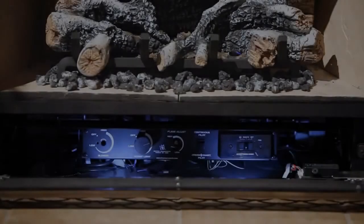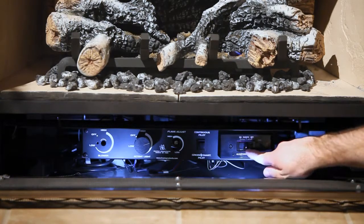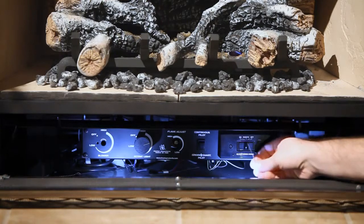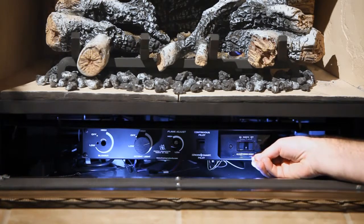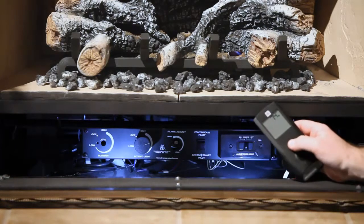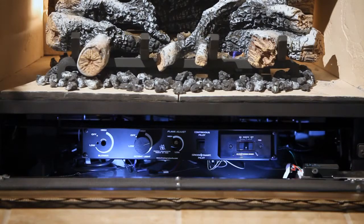If ever you're trying to make adjustments on the remote control and you get no reaction and no audible sound from the receiver, you need to reprogram your receiver. The receiver is located underneath the fireplace. It's very easy to do. Make sure you're in the remote position here. Use something like a paper clip. Press in through the program buttonhole. Hear the audible beep. Press the on button. Release. You've now resynchronized your remote, and the unit will turn on.